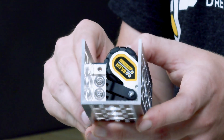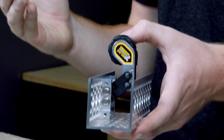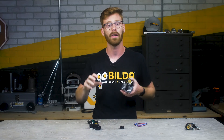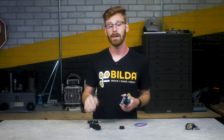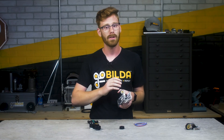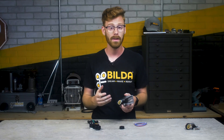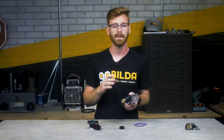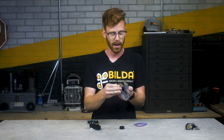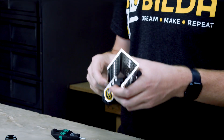There's plenty of travel in this system to account for even some small bumps or pieces of terrain you might have to drive over. We did some pretty thorough stress testing. The plastics used in this pod are really nice engineering grade plastics that include some fiberglass fill. One of the reasons we picked plastic here is its ability to flex and return to shape — if you hit a metal part enough that it's going to bend, it's going to bend and likely deform, where plastic really likes to bounce right back to the position it was in previously. This gives you some flex side to side, so if this were to take some impact, it will return right back to form and work just as new.